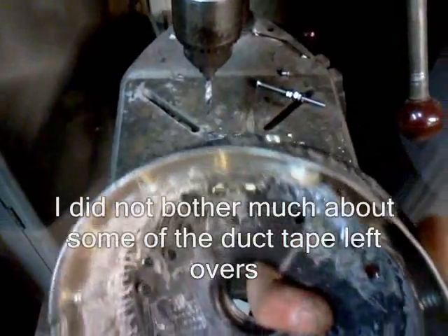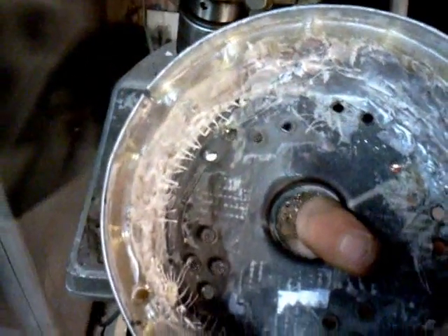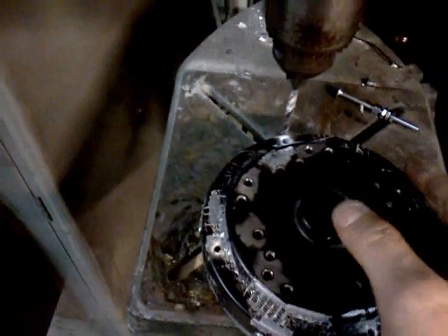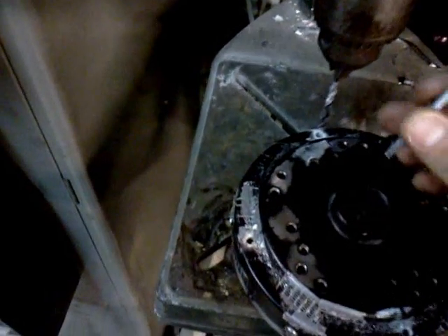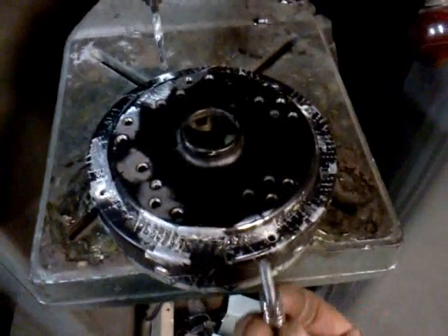Okay, now it's come down time. It's a little messy in there, but it's all clean. The stator doesn't hit or anything — it's good. I actually balanced it and it's pretty well balanced for all the resin I put in there. So now what I'm doing, as you can see, I already did a few holes — I'm just drilling out where the resin is so I can put some hardware in to hold the top half and the bottom half together.